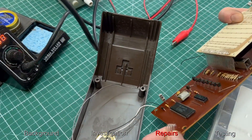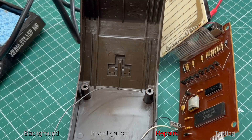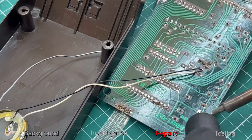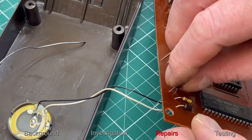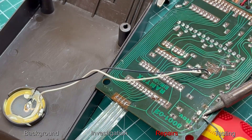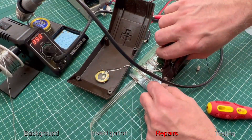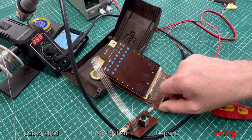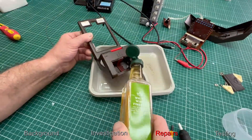Let's move on to replacing the original electrolytic capacitor — it's 47 microfarad, 50 volt. This is the modern-day equivalent, the same value but physically a lot smaller because over the years the materials used in capacitors have improved. We insert the new capacitor and solder it into place. As a new component has been installed and some reflow work done on the solder joints, I'm going to retest it on the mains power supply to make sure there are no problems. The check was all okay, so we're moving on to the battery compartment.